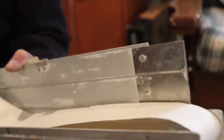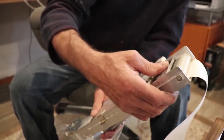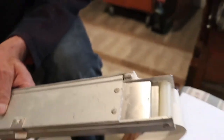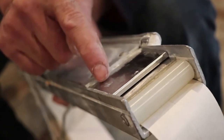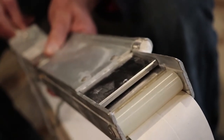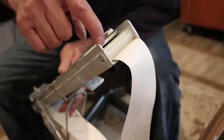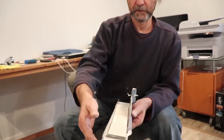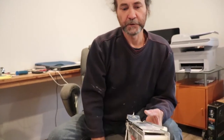Once it closes, once I tighten up, this gap gets less and less. So if you want less mud, you close it more — you can see this part is bent, so it releases and just flexes back, and then the gap would be bigger and there would be more mud on the tape. This is a very simple tool, but it's very useful, especially if you're doing a bigger job.